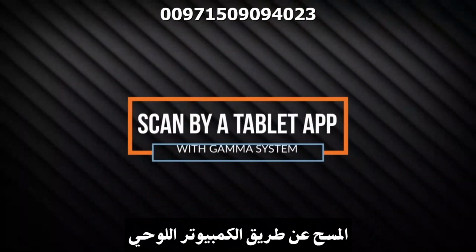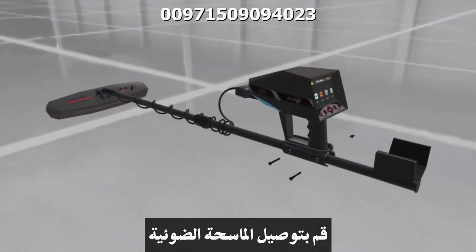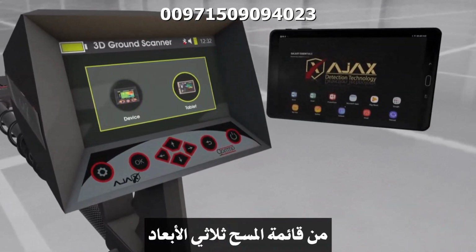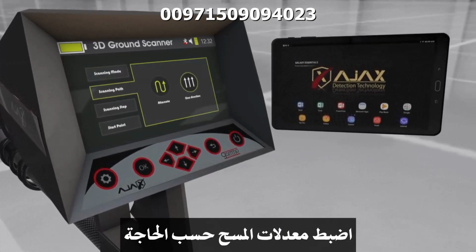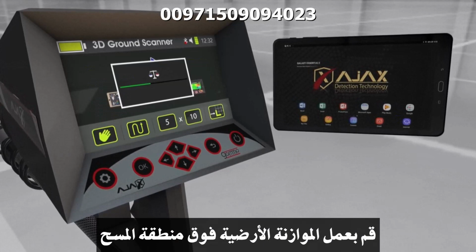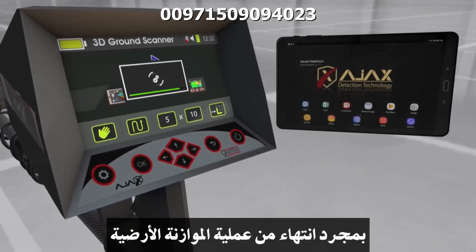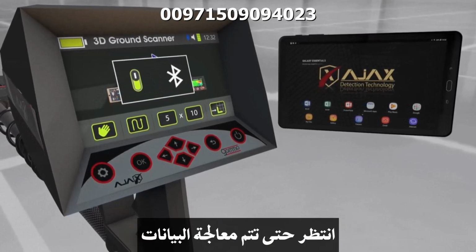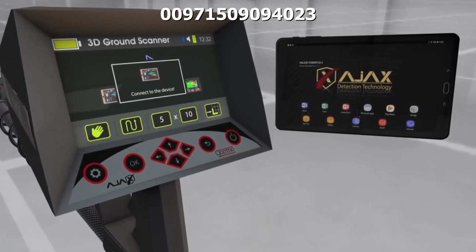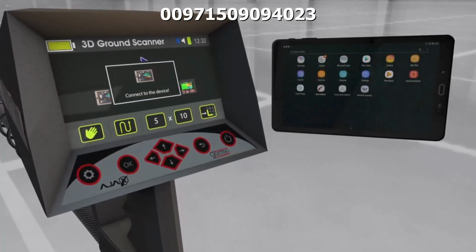Scanning with tablet. Connect the imaging scanner. Select Tablet Scan from the 3D ground scanner. Set the scan parameters as needed. Do a ground balance over the scan area as mentioned earlier. Once the ground balance process is over, wait for the data to be processed and turn on the Bluetooth if it is off. A window prompting the connection to the tablet shows next.